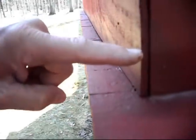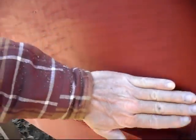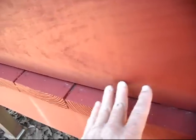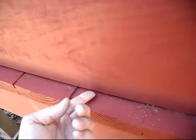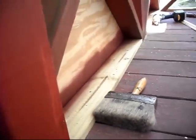Either drag out my small table saw, or I might just use the power planer. I might just do that. If I can get a 2x2 and drop it in there, that might be my option. Get a 2x2 and 45 it, so that if you're looking here at my finger comes down like this, the water has a tendency to go out like this. Not a 100% guarantee, but it's better than leaving it like this and just caulking it, and you're going to get water in here. And being that this is still open, you're going to get water coming in here anyways,